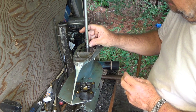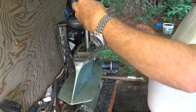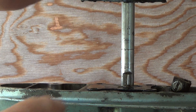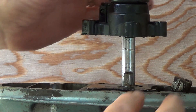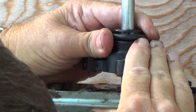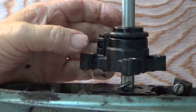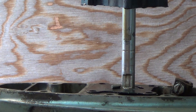And here's the tricky part — putting this tiny pin right there. What we're trying to do is hold this pin in here and line it up with the groove in the impeller. Let me put some more grease on it before I lose it.